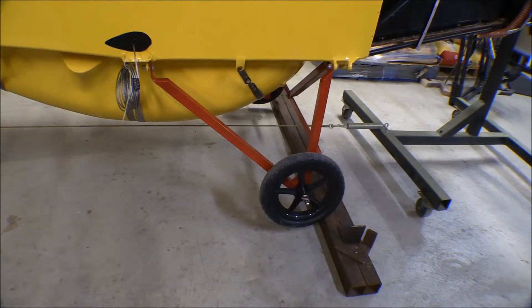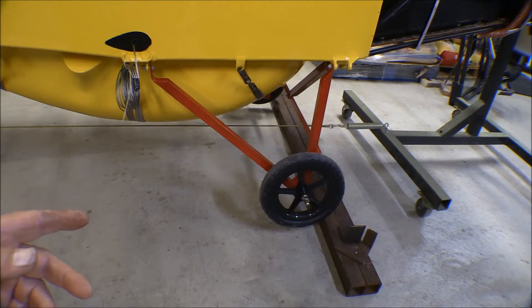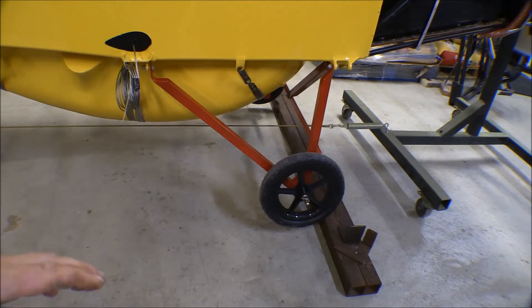I've got the bogey gear mounted up there, getting ready to move it down to the hangar. I built this bogey gear exclusively for rolling the airframe back and forth between the basement and the hangar — it's never meant to be a work platform. Those little wheels are just off a kiddie push bike, not intended for anything heavy. This thing is too much for it. The axle on this one might be bent a little, and I noticed when it sat in the sunshine that the plastic wheels would get hot, deform, and go flat — but they've served their purpose.